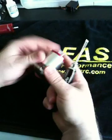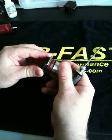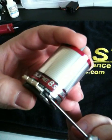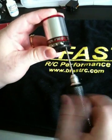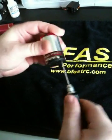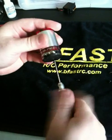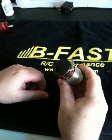Factory out-of-the-box timing is 12 degrees, so that's where I'm going to put this motor back. That's right here — this one tab is going to line up with the decal on the motor. So I set it at 12 degrees and snug up the screws. Just snug, not tight — you're not having to wrench this down. It's not holding anything in position other than keeping the motor timing plate from moving. That's it.